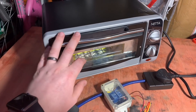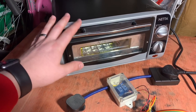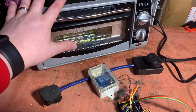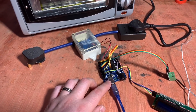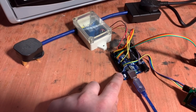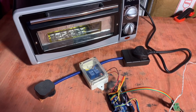For the last few weeks I've been using this cheap and very small toaster oven as a reflow oven here in the shed. I wanted something small because space is very limited here in the shed so I've had to move to a different bench entirely. That oven has been controlled via this relay and the Arduino Uno here, this 16 by 2 LCD screen and a cheap thermocouple module using the Rocket Scream sketch. I've done about 12 or 15 boards in this oven and each one of them has worked very well.